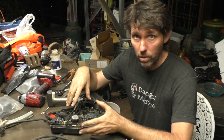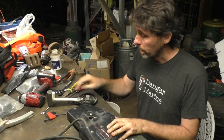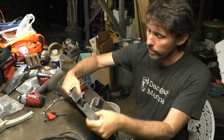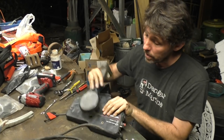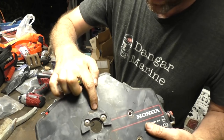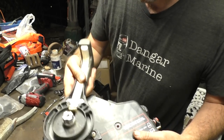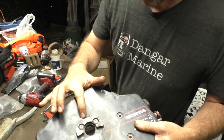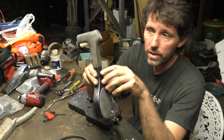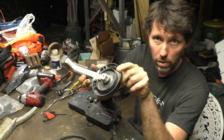There are a couple more sections on the mechanical side before we go into the electrical side. If we come to the front of the control panel, we'll see there's a little notch just here, and this is where this lever goes through. This came off because we unbolted from this side. When I lift this lever up, it pulls that white plastic part out of this groove here, which is what allows you to change gears. So if you find that you can't move the lever, sometimes it's because that bit's broken and just resting in there and catching. This outboard obviously didn't have trim tilt from the forward control, so there are no switches here — otherwise you'd actually have wires running down here as well to run the trim tilt.